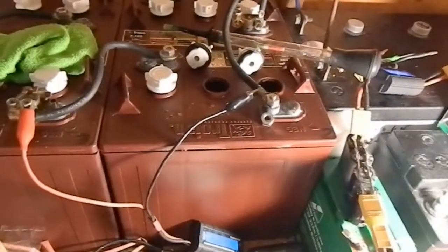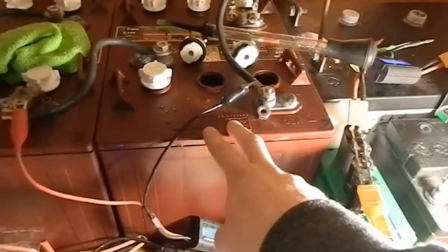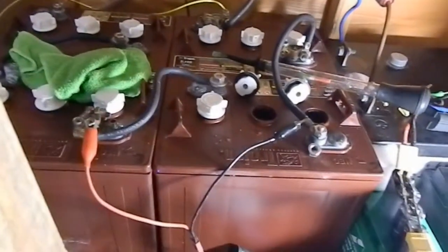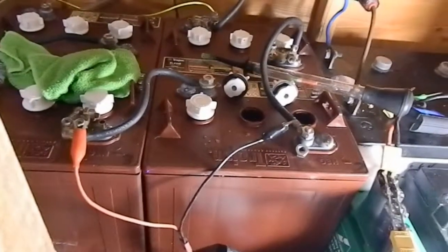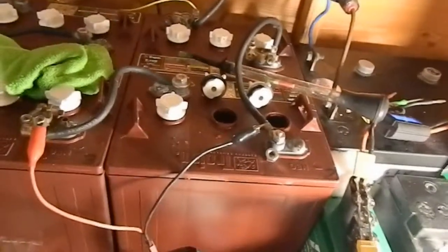With lead acid in particular, not all cells are created equal and you will get some variation — and it seems to be this cell here that has suffered the worst. These two batteries here are actually a bit newer than the others, with a couple of months or more of age between them. I used to have a 12 volt system with these two in series alongside the big one before I bought the others, so maybe the age difference has caused a bit of a problem as well.